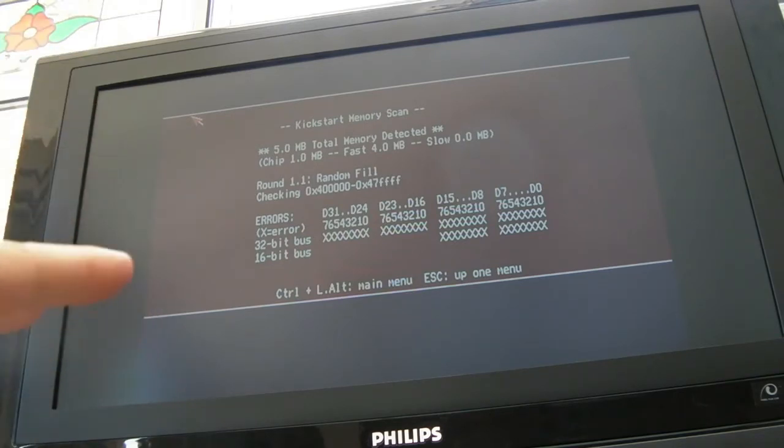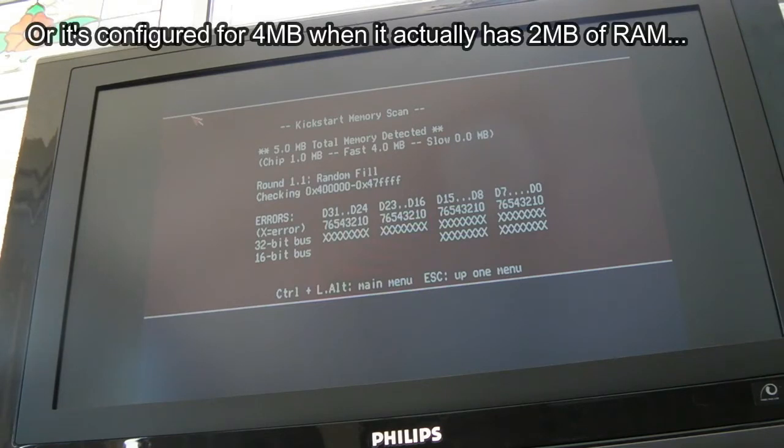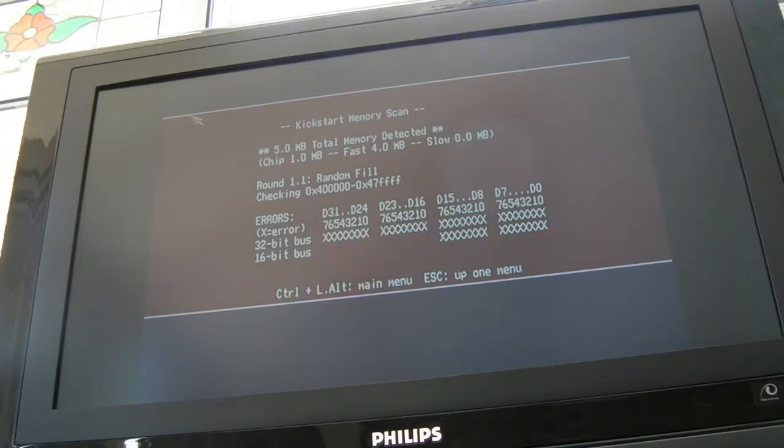I've seen this before when the RAM expansion doesn't like the particular board it's in, or doesn't like something else that's in there with it. So, for example, I've seen this with the 2630. I've also got an A2091 that we'll test here as well in conjunction with this, but until I get it working on its own, with no other boards, there's no point in even testing it.